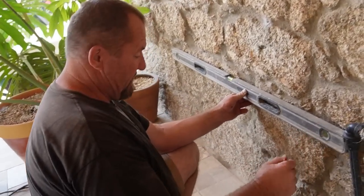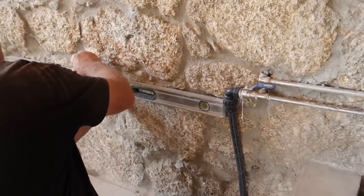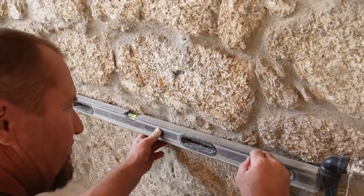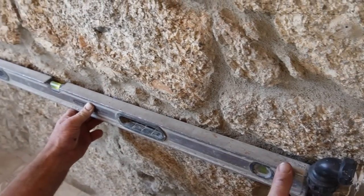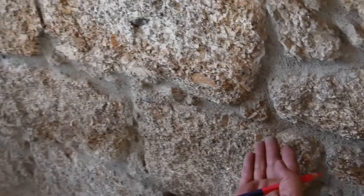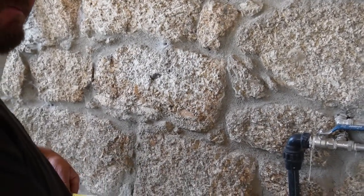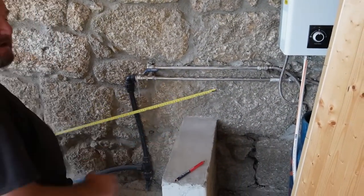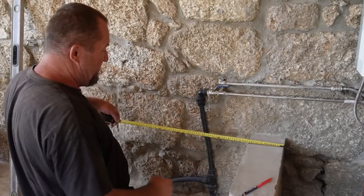Okay, so I've measured 600mm off the floor to the top of here, and we'll put a mark here, where it touches. That mark represents the underside of the timbers I've just made. And I put this on here last night so it's dry. Today I can stick the bench onto there with the other legs, so I need to measure from here.